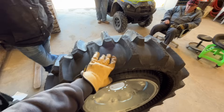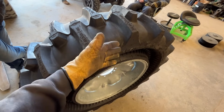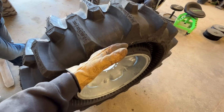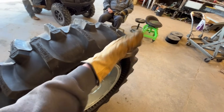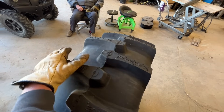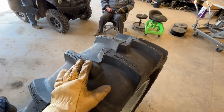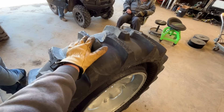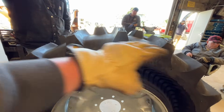A few things about these: they're self-cleaning. With a normal tire you get a bulge where the air is, creating big humps in the pivot track. But with these, instead of pushing mud out and forming a big mound, the mud just passes through and you get a flatter track. They're also a bit wider because they don't curve like an air tire, giving 30 percent more surface area on the ground, making them act more like a track. When it sinks in, you get quite a footprint.